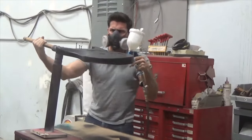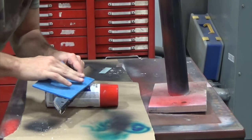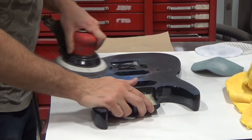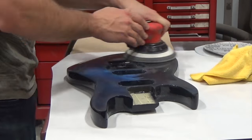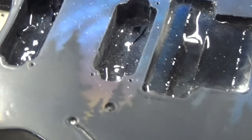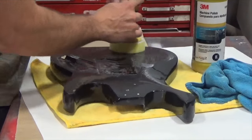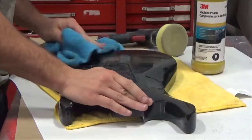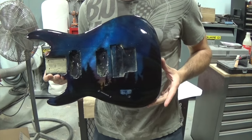Here I am spraying the 2k clear coat. I'm not going to make you watch all of that — partially because I get in the way here so you can't really see it anyway, but you've seen me clear coat before, and I've got several videos where I do that. Once the clear coat is cured for a week or so, I go in and sand it all down flat to 5,000 grit to make it easy to polish and get a nice high gloss out of it. Going in with my dual action orbital at 5,000 grit — that's basically a satin finish right there. It's incredibly smooth and makes it much easier to polish. I go in with my rubbing compound, my machine polish, and then my extra fine machine polish. I use 3M polishes for this job, and I ended up going with a satin finish for the back of the neck.